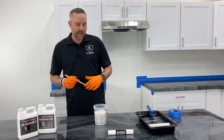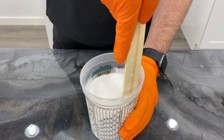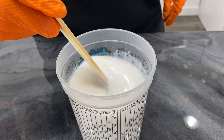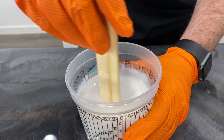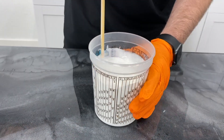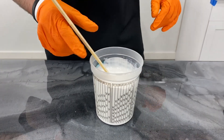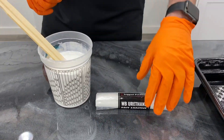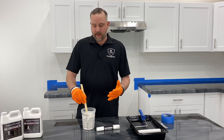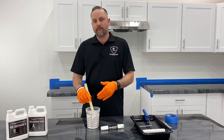This mix is really easy — we can mix it with a paddle or a stir stick. We want to scrape the sides as we're mixing, scrape the bottom, and get into the corners. We'll mix this for about two to three minutes, scraping the sides throughout. If you've purchased the grit additive for extreme scratch resistance, you would start slowly dumping it into the urethane as you're mixing — about right now — and that goes for gloss or matte. If you're adding grit with the matte, you add it after you've started mixing, just the same way.